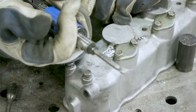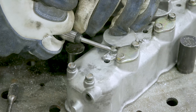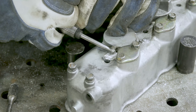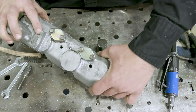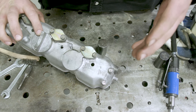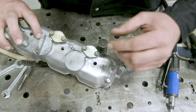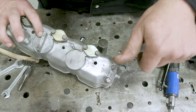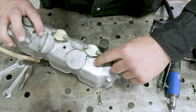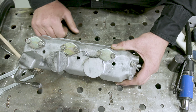I'm controlling the RPMs with my index finger underneath — don't run it wide open. Take your time on top because everyone's going to see this. It's non-critical in terms of tolerances; it's just a stud hole. The most important thing is making sure this seating surface is nice and level — that's where the copper crush ring sits, and that's what does the sealing when you put the nut on and hold the valve cover down. That's the most important part.